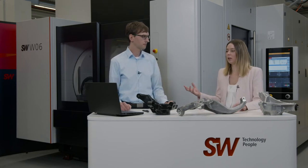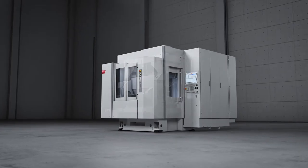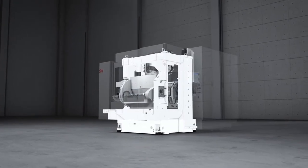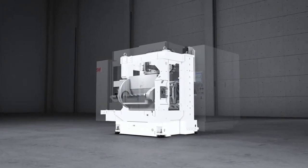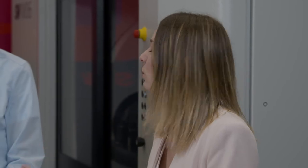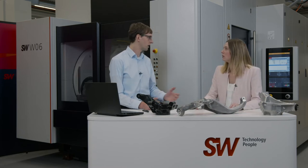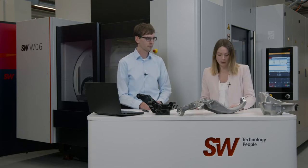You mentioned that the machines have to be very robust, which is of course fundamental to all our machines and part of our design principles. The monoblock is very helpful, especially in comparison to C-frames, which constantly have a lot of movement — especially with such heavy machining material, as well as the very dynamic forces relevant for light machining.